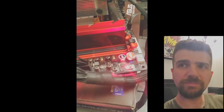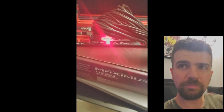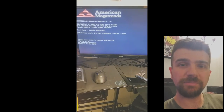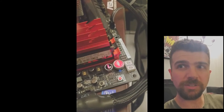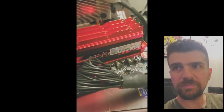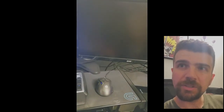Moment of truth. It's cycling — it's over 55 now. Power is engaging. Monitor flashed on — boom! 8 megabytes, so it reads it. Code 99. Alright, this is for all the money — we're going to try all four sticks. Boom! 99. And there we go — all four in. Boom, boom, 99. One turns on, it posts 32 megs!